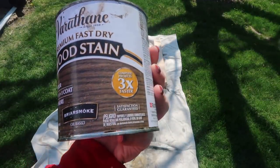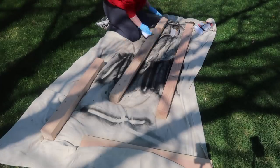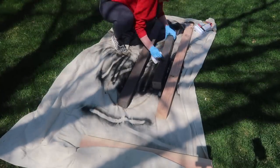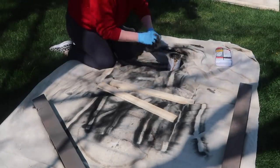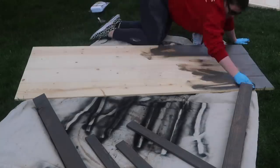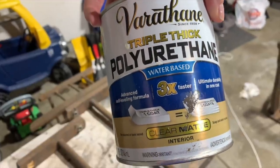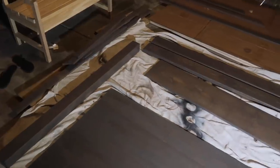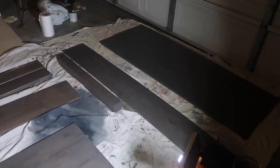Then it was time to work with the wood stain. I did everything in our bedroom in Briar Smoke by Varathane, which I really like. A lot of stuff in our house is Dark Walnut by Minwax, which I also love, but I wanted something to put on everything in the room so it all looked like a completed bedroom set. The Briar Smoke has a little bit of warmth to it, and with our walls in that room being gray I wanted a little bit of a gray tint with warmth — and that's what I found in this stain. Then once all the stain was dry I went through and gave everything two good coats of Varathane polyurethane. I did two coats because this is a used piece — I wanted to be able to wipe it down without worrying about anything getting into the wood. We let that fully dry overnight and then it was time to assemble.